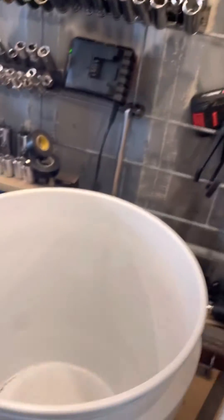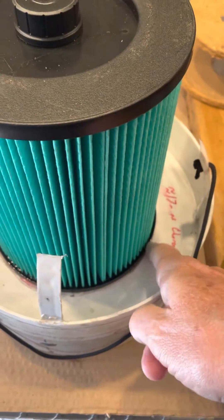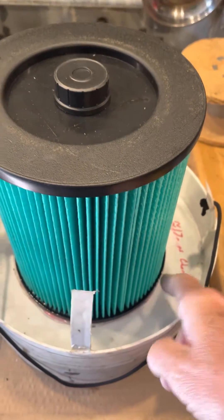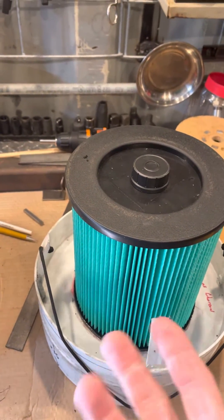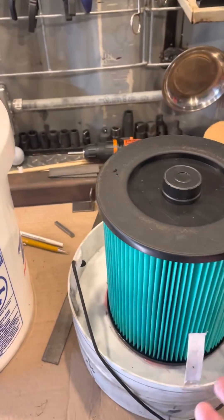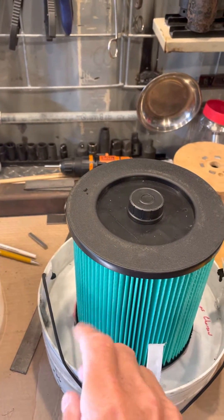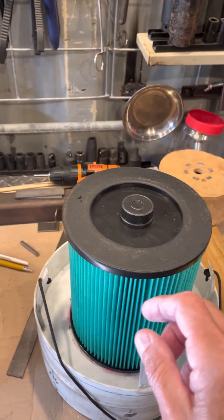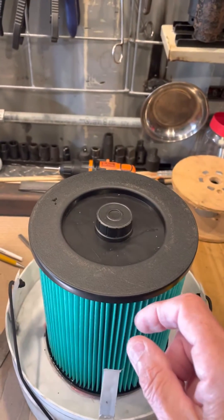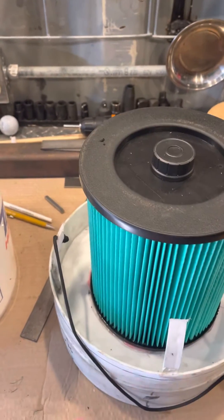It's got plenty of room. I attached it down here with just some silicone, so now the airflow comes up and goes backwards through here. That's okay because the outside of this filter, when flow is going through this way, acts as a roughing filter — it catches the big particles so it doesn't clog up the HEPA filter, the high-efficiency particulate filter part.